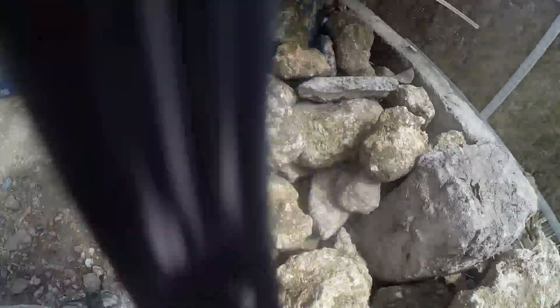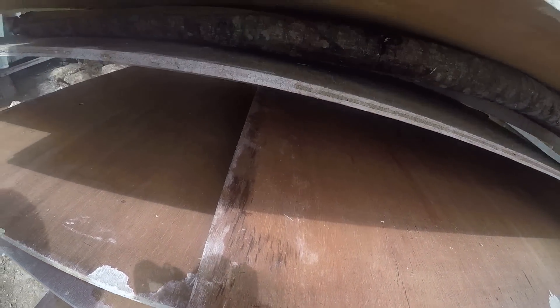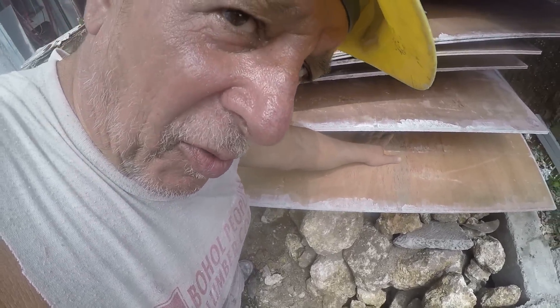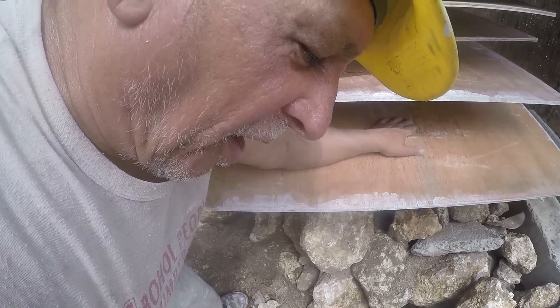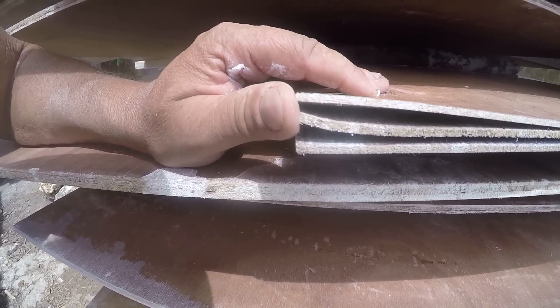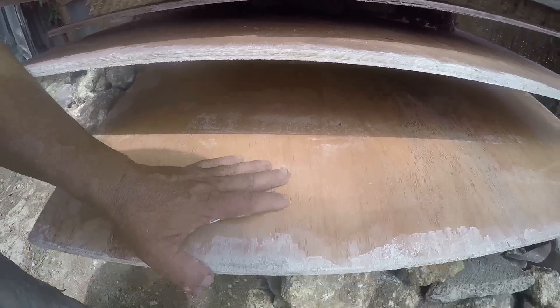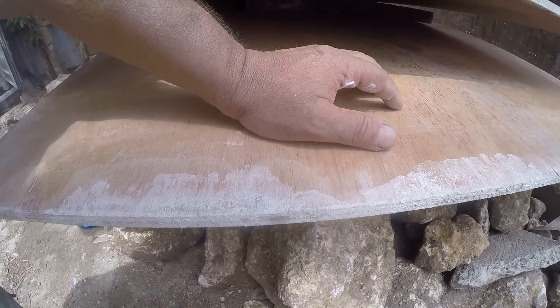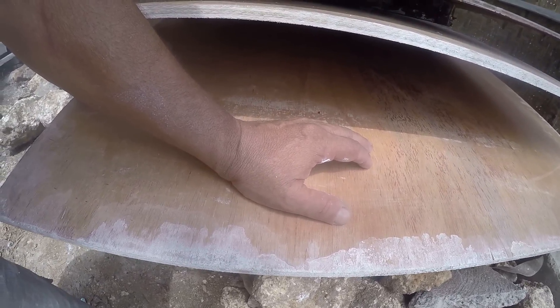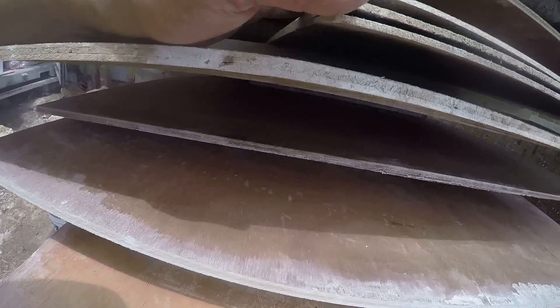So this is what we have — for 12 dollars or 700 pesos — and this is what we have for ten dollars or 500 pesos. This is one pissed-off Rabbi Joe Barker saying: marine plywood is just that — it's not supposed to have voids in it, not supposed to be flaking after a single rainstorm, and not supposed to leak water through. I can't tell you how many boats they built out of this stuff, and then six months later the boats get waterlogged and they're replacing panels because there are voids in the plywood, or it separates like this even before they paint it.